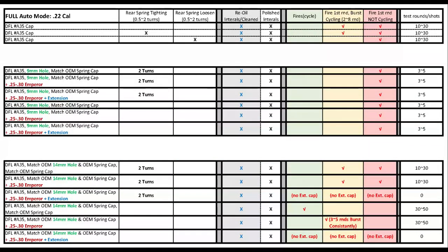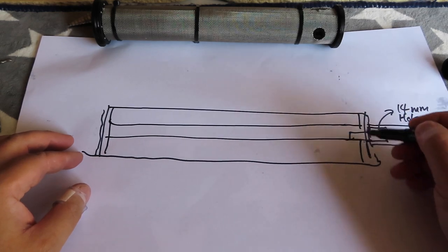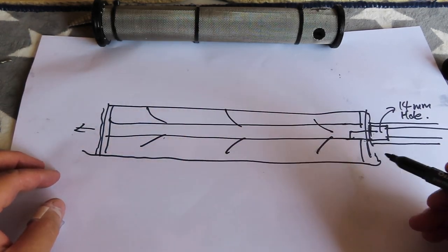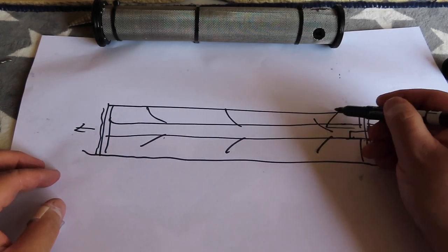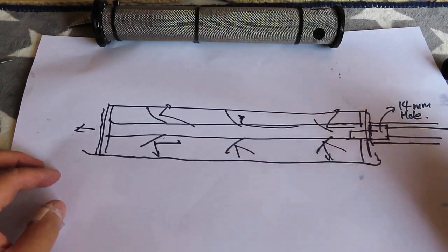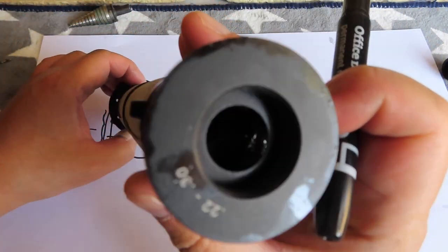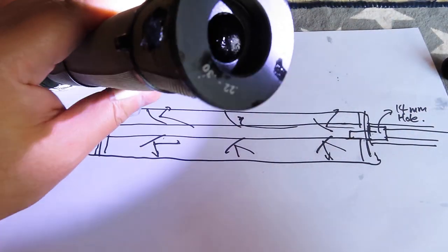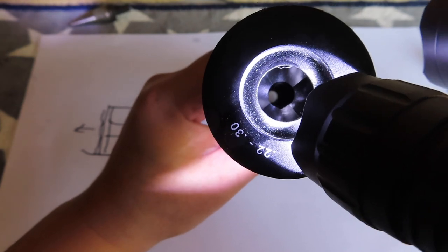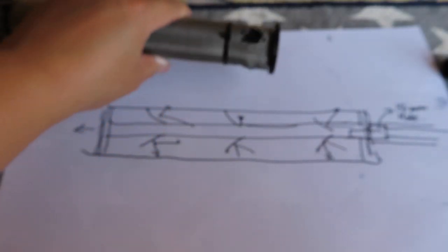And Donny's silencer basically works this way. The bullet is going to travel through this tube and come out here, and he has a lot of baffles in here, and as the air travels, the sound will be bounced off into a softer material, as many silencers do, basically bouncing off a softer material on the outside core, which is this piece. It's a wire mesh, inside there's a fabric, okay? And if you look carefully in there, I'm sure you can see it, there's a baffle. It's really hard. You see there's a baffle? Let me see, you see a baffle right there? The smaller baffle hole is basically the same diameter as the 3mm. There's a bunch of these inside of this to bounce the sound off.